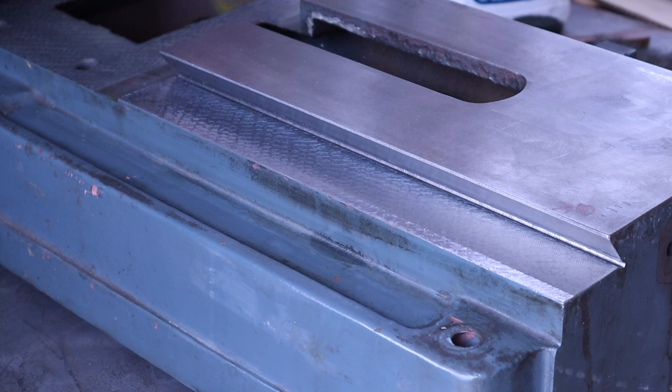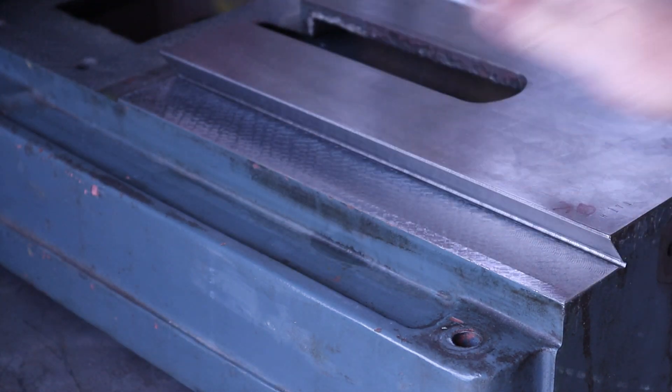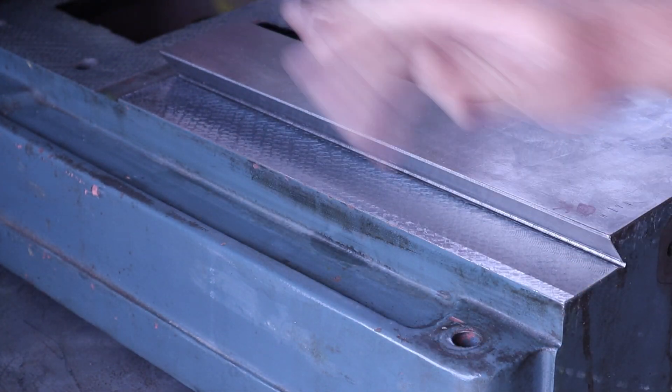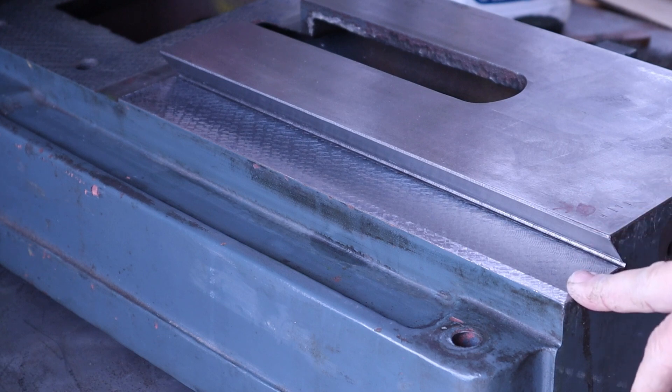What I'm going to do right now is blue up my straight edge, put the straight edge on here, then blue up the other piece and slide it underneath the dovetail to get an idea of where the reading is currently. I've done probably seven passes on this side and five on the other side. I wanted to focus on this side to see where I'm at between the two. In order to do that I have to get this relatively close.